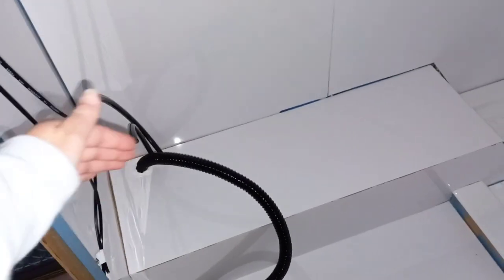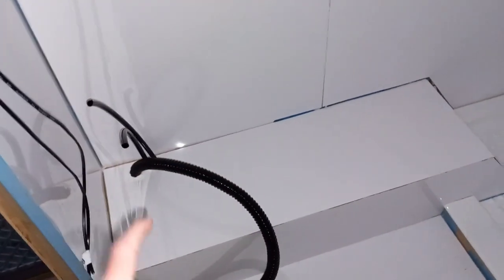So we did the water pipes towards the back of the wall because there's going to be a hollow gap behind the vanity. The vanity is still going to sit towards the front of the wheel arch. Now we did that mainly because we do not want those water pipes to actually take out any of the crucial storage. Now we are also going to be doing a little bit of wall paneling along the top to seal and then to the side. So at any angle you're standing, you'll not be able to see any of the hollow behind the vanity.